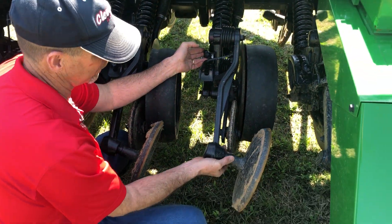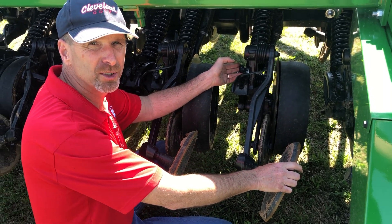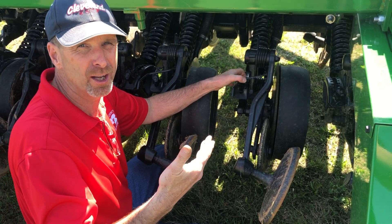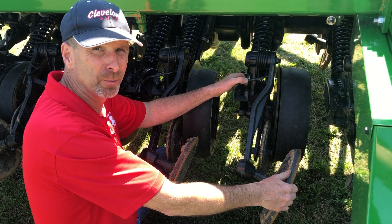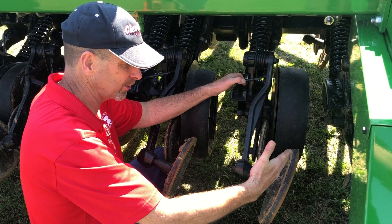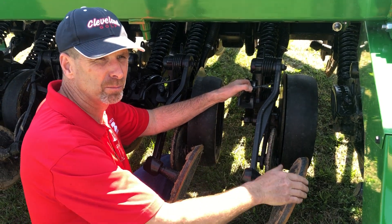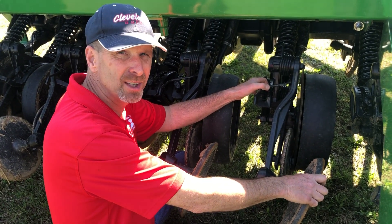Regarding down pressure on the closing wheel: in most instances these closing wheels are pretty heavy and on a long arm, so you really don't need much down pressure. Right now this is set at the highest pressure setting. Unless you're dealing with a situation where it's just not closing up that seed trench, I would back that off a little bit. These closing wheels can actually plow a bit as you're drilling — they run at a slight angle both laterally and longitudinally — and they can get aggressive if pressure is set too high, which could change your seed placement more than you want. Use no more pressure than is necessary to get the seed trench closed.